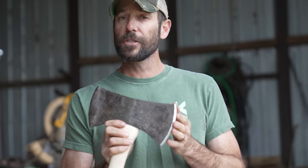For all practical uses, this axe is done. Unless you're going to be carving with this axe, there's no practical reason to take it any farther than this. It's actually shaving with nothing more than a couple of files and maybe five minutes of work from absolutely no edge at all. But because I like a challenge, I'm going to go ahead and refine at least one of these edges to an absolute razor blade and see if we can make this thing slice paper like you see with those fancy Japanese knives.